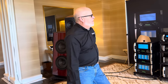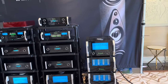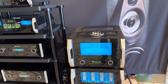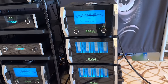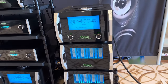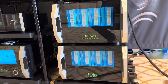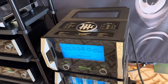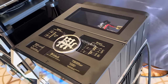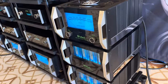There are multiple products coming out throughout the year to commemorate the 75th anniversary. The first one is the 2.1kW, which will replace the existing 2kW. There are quite a few enhancements — primarily the big change is the capacitor bank: we've doubled the filter capacitors, which means twice the dynamic headroom. These are actually driving the Suprima subwoofers, and being solid state, double the headroom gives you a much faster response for low end.